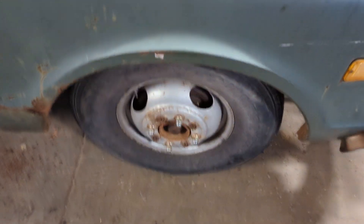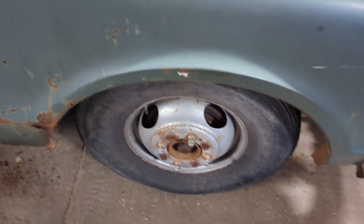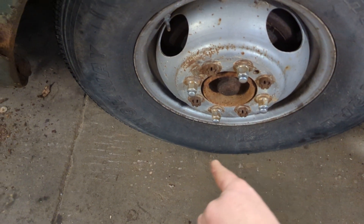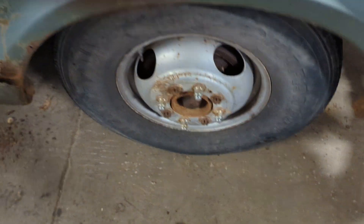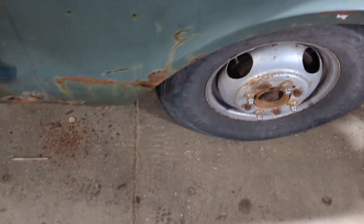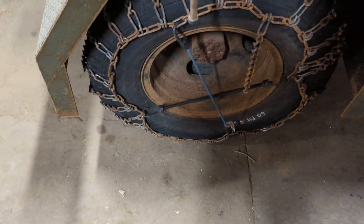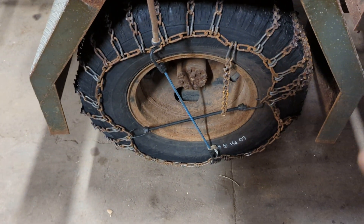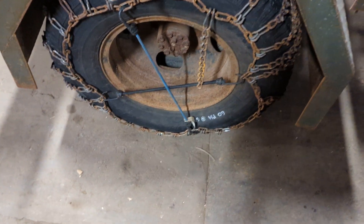One of the first things we like to do is check our tire pressure. The best way to check it is to find out if you've got a big bulge down at the bottom there. That doesn't look too bad, so we just give her the old check test. That's probably about 80 PSI. Back side here, we like to run about 60 PSI, especially with the chains — you've got to have that little bit of give in there. Can these feel a little bit softer?